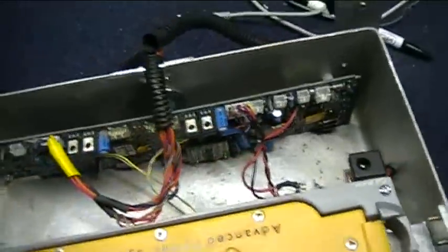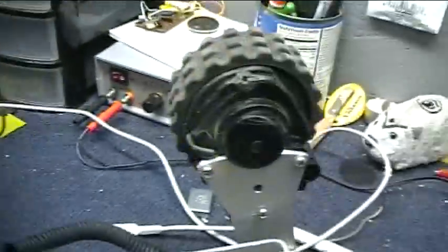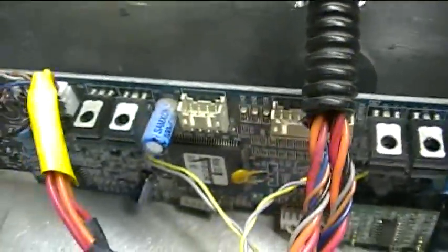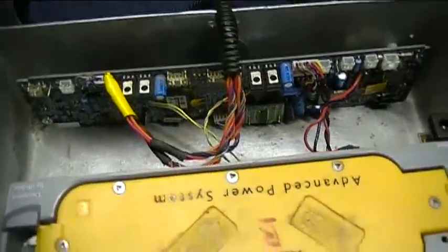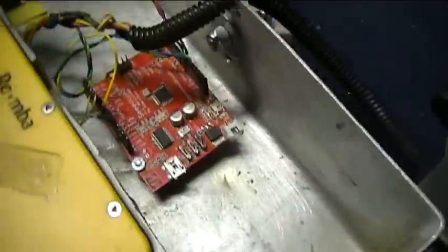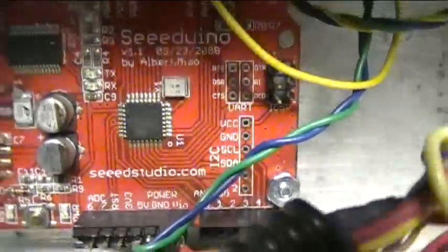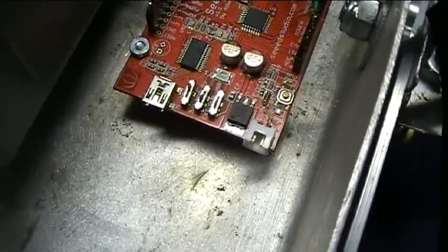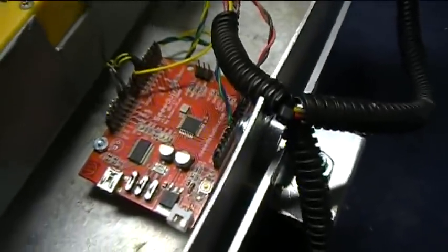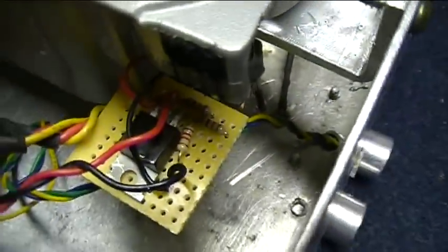Let's take a look on the inside. There's the Roomba main board right there. The only thing I'm doing with that is utilizing the H-bridges — there's one there and one over here, and each one of those runs a set of wheels. They're triggered by those little yellow and gray wires. On the DinoFab site there's a breakdown of those, and I'll also put it on Hack-A-Week. And here we have an Arduino clone from Seeed Studios — it's a Seeeduino. Seedstudio.com. It's got a mini-USB connector on one end, and it's switchable 3 and 5 volt output. I've got the wires hooked up here to pulse width modulation output. There's my little LM317T voltage regulator that I'm powering the Arduino with, put together on a little perf board.